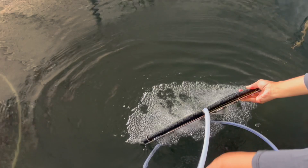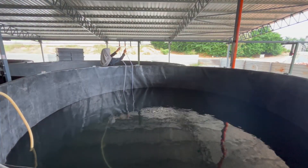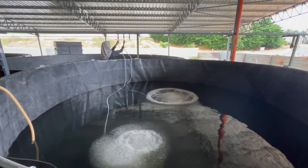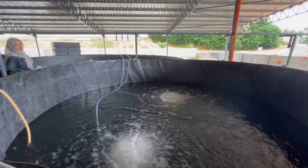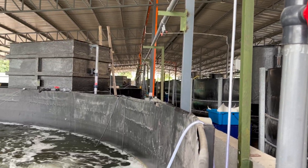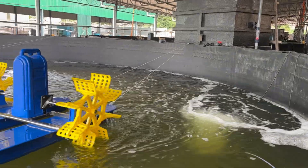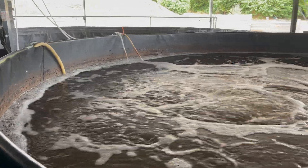With this 20 horsepower unit we can actually power the whole new farm and even the older one. You can see that one tank can probably house up to 5 to 10 units, so they are actually quite strong in aeration. These air diffuser tubes are more coarse in nature so that they are a bit stronger in terms of fouling capabilities. As you can see, this is one of our tanks which has both paddle wheel and aeration frames from the root blower, and it's actually quite good in terms of aeration capacity.